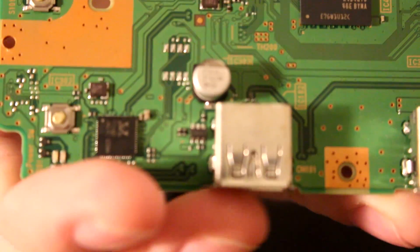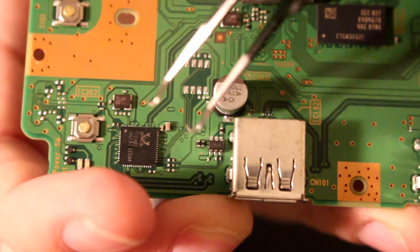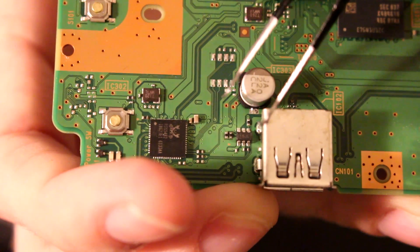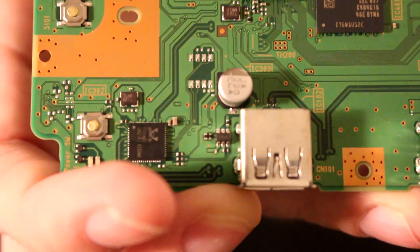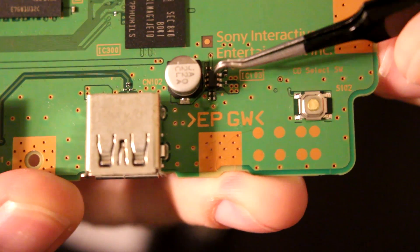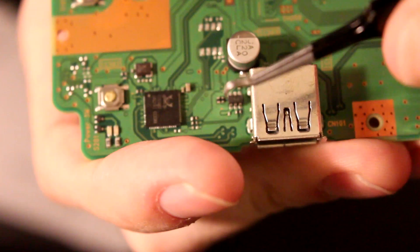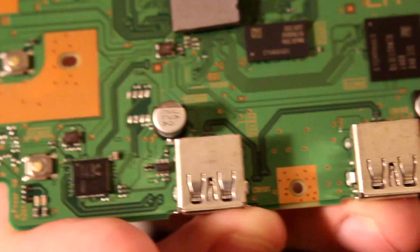Here's a close-up of the PlayStation Classic motherboard. This is the first controller port, and right here are two resistors that determine the current output to those ports. The chip right next to it is the current limiter and reverse voltage protector on that circuit. On the other side we have a very similar setup but in a more inconvenient location — this is the current reduction chip and these are the two resistors that set that value. We're going to put a short across these two resistors to tell the chip not to do any current limiting and open it wide up.